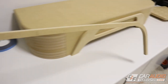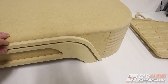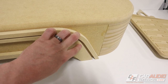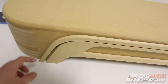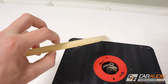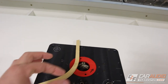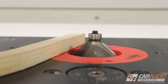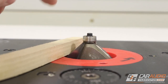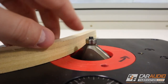The second way — and I prefer this — is to stay away from body filler because it takes time to cure and requires sanding. Instead I've made this same piece but expanded it with a gap of about 3/16ths of an inch, which is perfect for my carpet-to-vinyl transition. That chamfered look we'd get from sanding the body filler I can do precisely on the router by adding a 45-degree chamfer. This piece is a half inch thick and I expanded the shape a half inch, so when I do the 45-degree cut on the outside it will be a complete triangle profile in cross section. I need a surface for the bearing to ride against, so I'm going to stick this to a quarter inch piece of wood and flush trim it on the router.